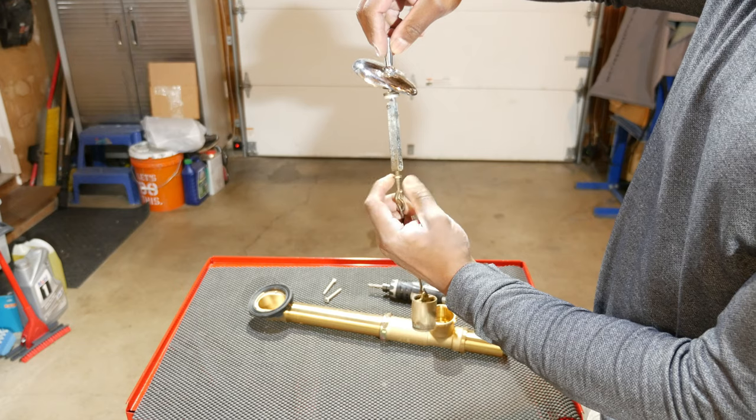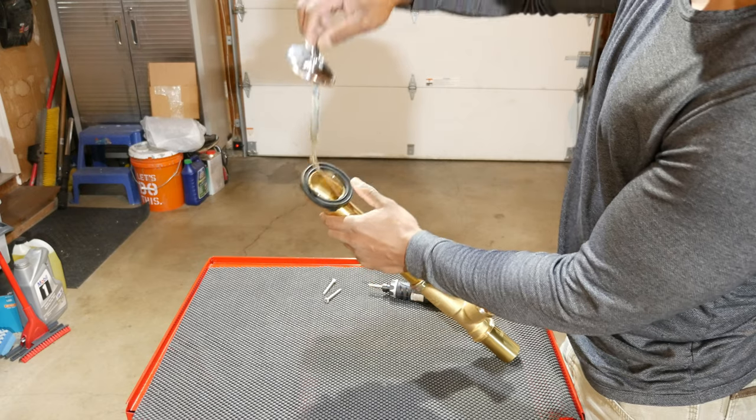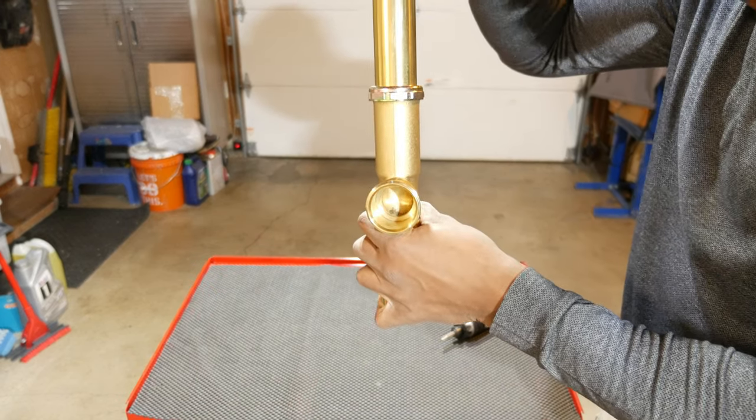This allowed the end of the plunger to fully clear the ridge in the T, and at the same time not partially block the drain. That wasn't all that difficult — basically all I did was play with it, found the catch point, and then adjusted the plunger about a quarter inch below that, and it was just perfect.